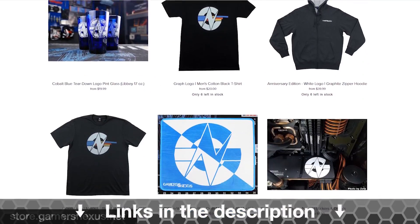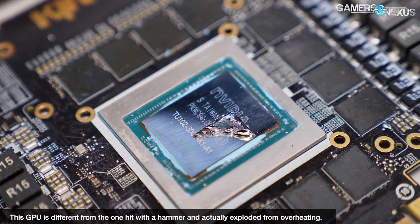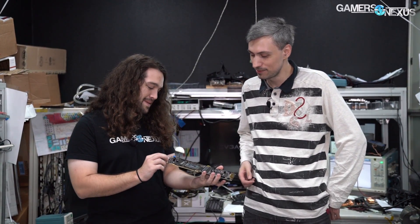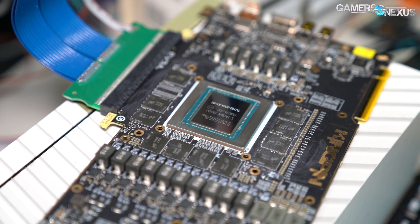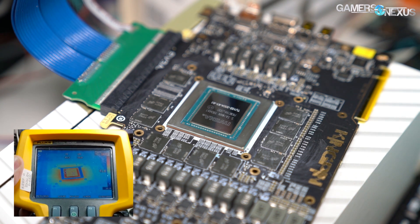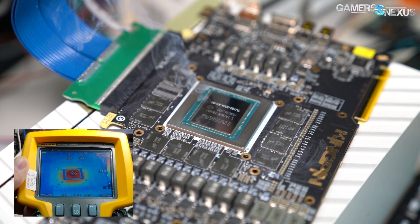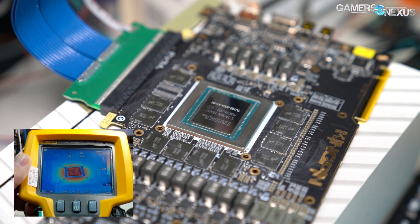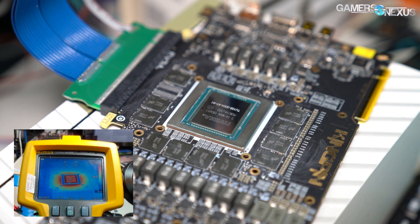I'm with Tin from EVGA. We've done a few videos here, and he's presented me with a GPU that has a crater in it. It's a victim of somebody forgetting to turn on over-temperature protection after a bench session — the GPU overheated but power was never cut off and the GPU exploded. We have demos of overheating where we got cracks on the die and a big puff of smoke. This shows why thermal protection exists on every VGA card and motherboard, especially for extreme overclocking experiments using liquid nitrogen or water cooling, where pump failures can occur.